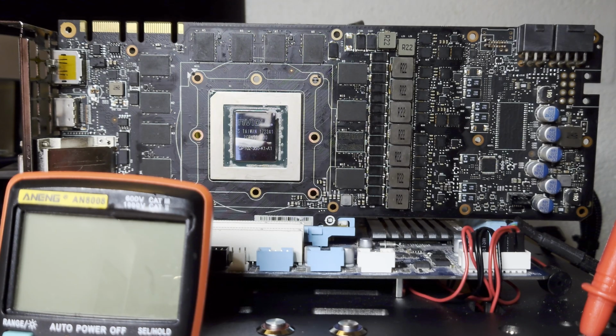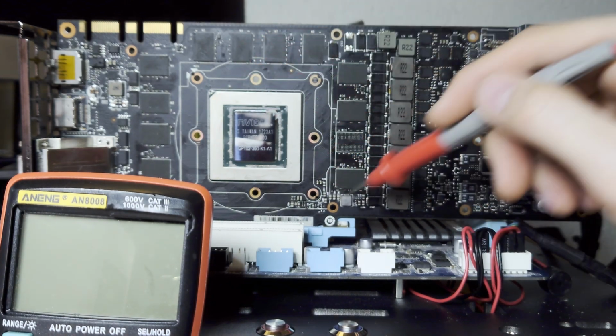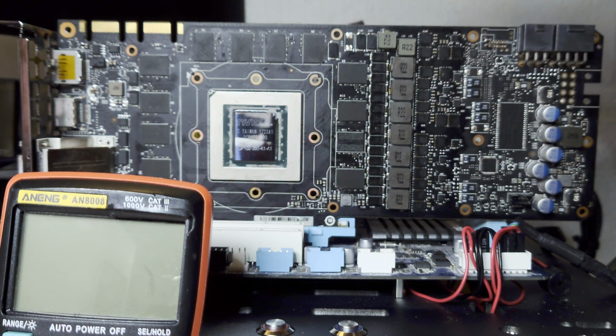Okay, so as you saw, we have memory corruption on banks B0 and C1. Just in case you've never used maths or you've forgotten already, the ordering is as follows, going from the top left to the bottom right, counterclockwise: A1, A0, B1, B0, C1, C0. So what you notice is that our two faulty banks are this one here and this one here. You may also notice that they're right next to each other in the top right corner.